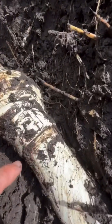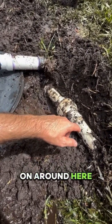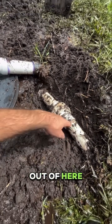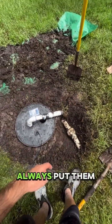With all the pool pump and noise going on around here, this joint is a bad glue joint, so there's water seeping out of it. That's the only reason we even discovered that the check valve was buried here in the first place. So guys, never bury your check valves — always put them in the basin.